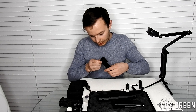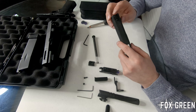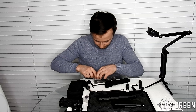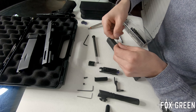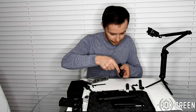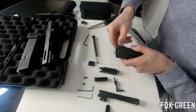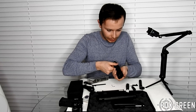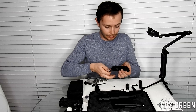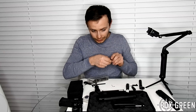You can see my gun has got a little bit of dirt on it - that's to be expected. Now we must look at taking off the front sight. One thing to know about this front sight is it requires an absolutely tiny allen key - like a half-millimeter allen key. Not a lot of people would have this size. This tiny tiny allen key needs to come out along with that very small allen key nut. With a bit of pressure you should be able to shimmy this out to one side and get it off. So there you go - that's your standard stroke upper completely disassembled.